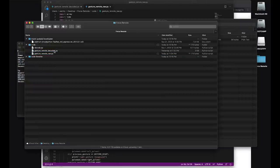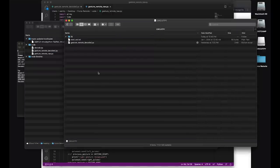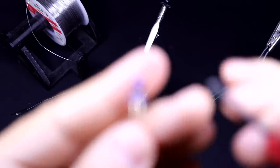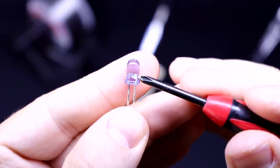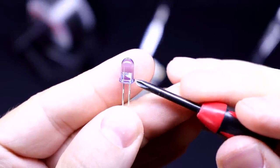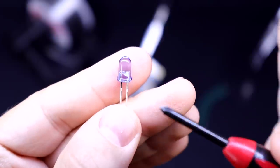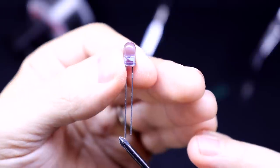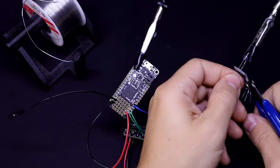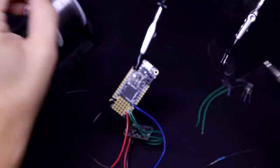So whichever one of those you use, drag it back onto the CircuitPy drive and rename it to code.py. Now we can get the LED ready and finish this thing up. If you look at the inside there's a bigger piece — that's the cathode, or ground. The smaller piece is the anode, or positive. The ground side should have a shorter leg and the positive side should have a longer leg, but we're going to trim those down so it's important to know which is which without looking at the length of the legs.